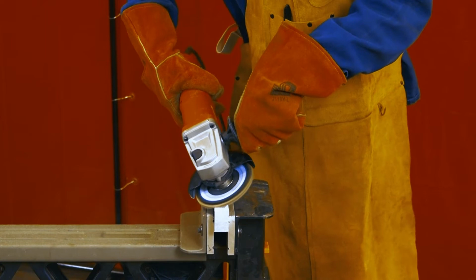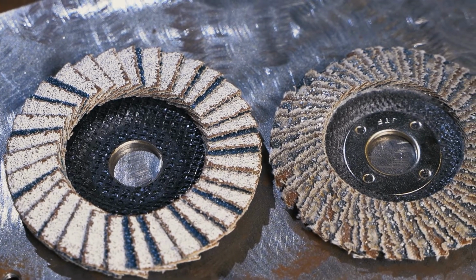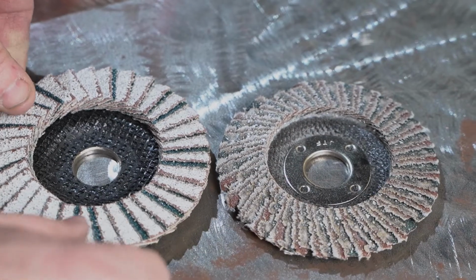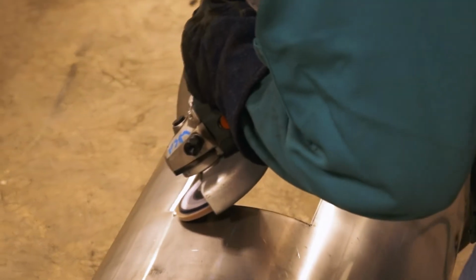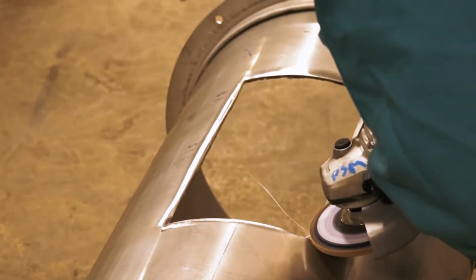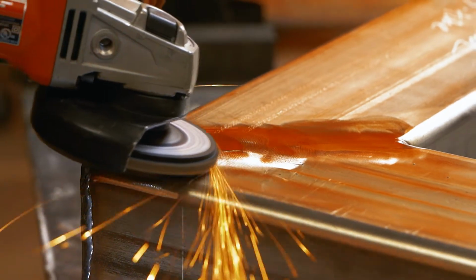When grinding aluminum, it is common for materials to stick to the abrasive, making them less effective. Look for a product designed to grind soft metals and resist loading. When grinding stainless steel, a top-coated abrasive is ideal for dissipating heat and reducing rework.